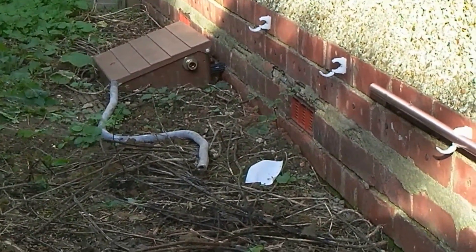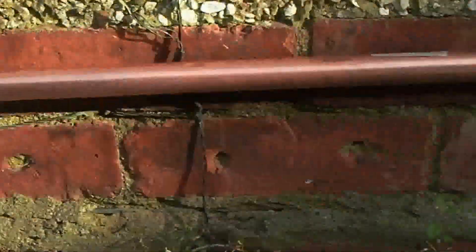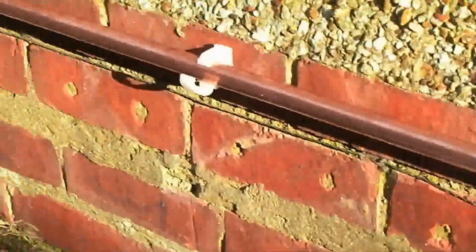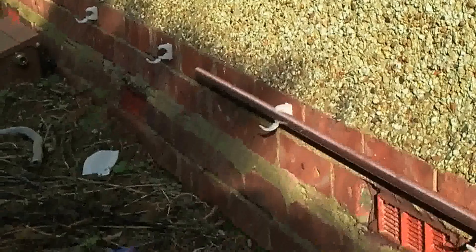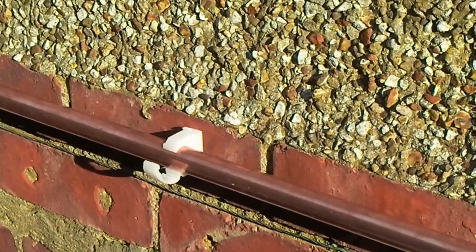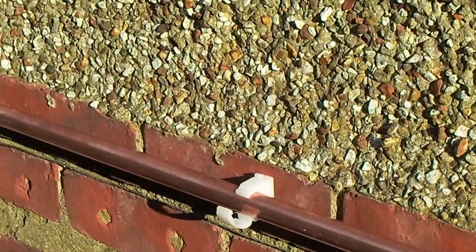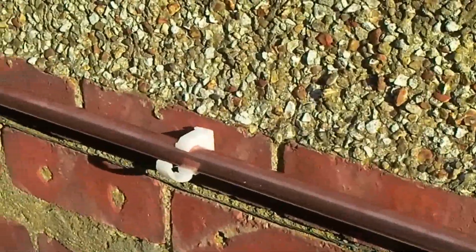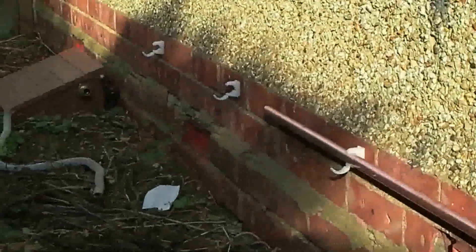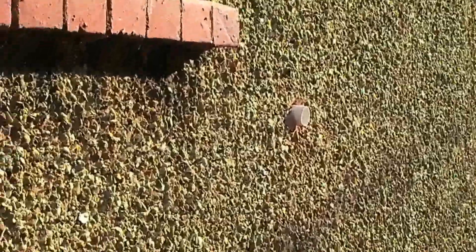Just a quick update — I thought that might be a useful tip about running the pipe along as you do each pipe clip. The only other thing I'd say: if you are using soldered connections, make sure you've got a pipe clamp either side of it. You don't want any flexing of the joins because the solder will crack over the years. So yeah, just that bend to do there, the second pipe I'm going to bend and up into there hopefully.